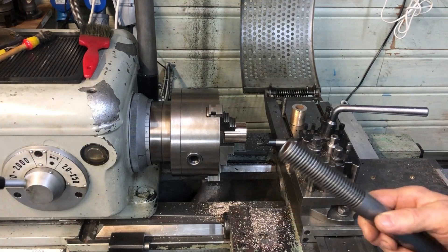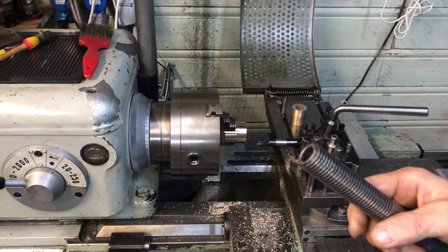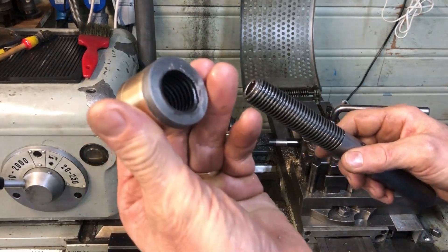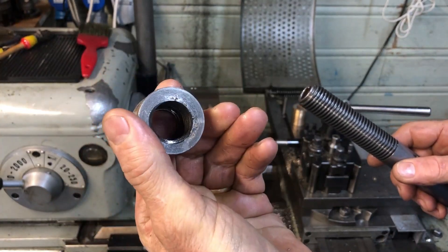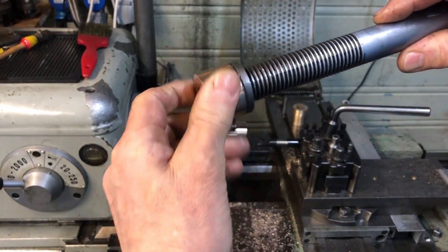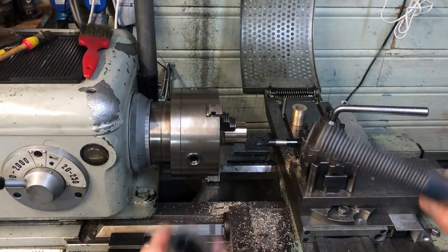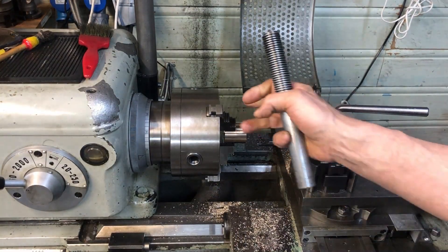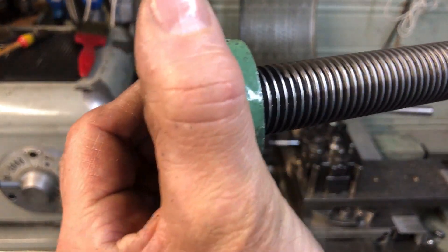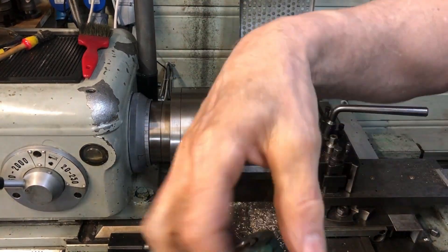Here is a normal situation for me — trying to figure out the easiest way to make this modification. I cut the old thread which was integral with the handle, since I don't want that anyway. I just glued on a piece of bronze which I will make a slot in to fit the old slot. Of course, the other way would be to make a thread. If I'd been a real machinist I would have made a new nut first. I made a trial in plastic and then I'll make it in bronze afterwards.